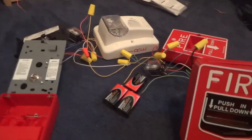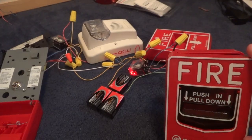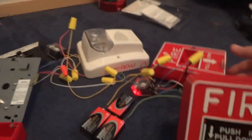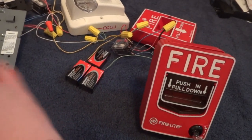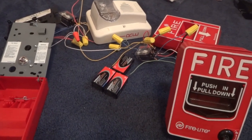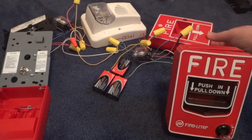This is only the circuitry so far, I still got a long ways to go. I'm just gonna activate and reset right now. So I activated it and reset it — the LED turned on because there's an LED in each of these relays. There are two of them and they'll turn on when the power goes so that the relay latches. This is being used as a reset because it's open.